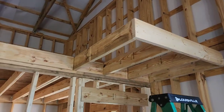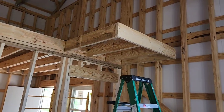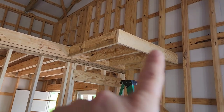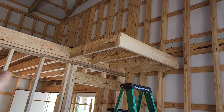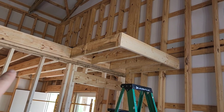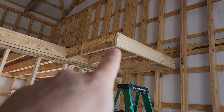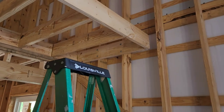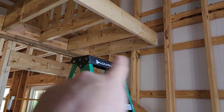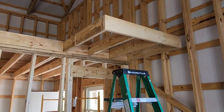I've got this cantilevered over — that's a 2x8x12 — and there's a 75% rule. If you're going to cantilever anything, you need to make sure that 75% of your board length is on the load-bearing wall side with only 25% exposed, and that makes it strong. Plus, we've got Simpson half-inch strong-tie lags in right there, so we're rock-solid on this cantilever.